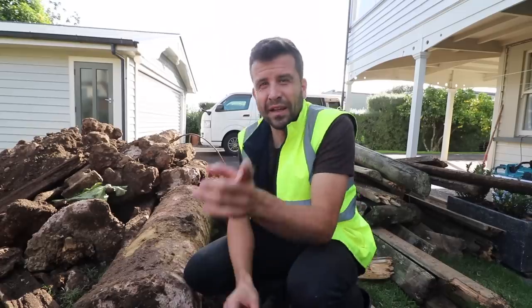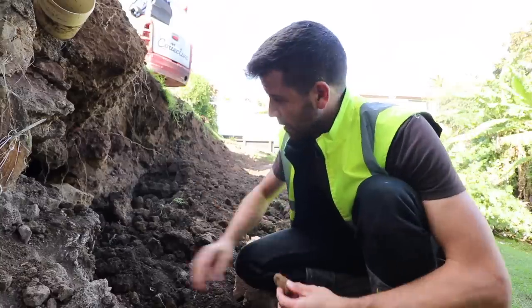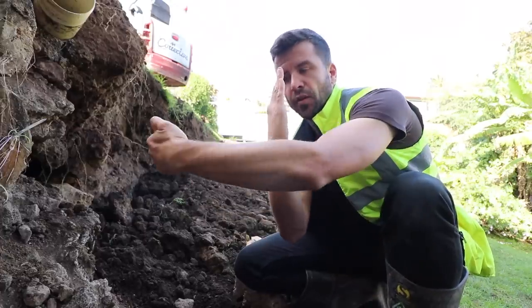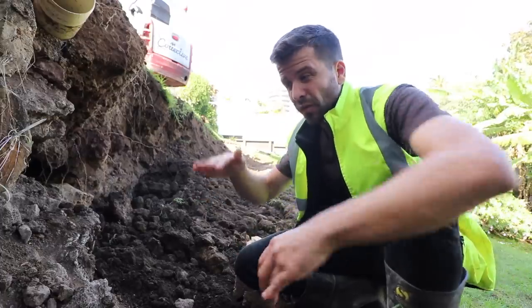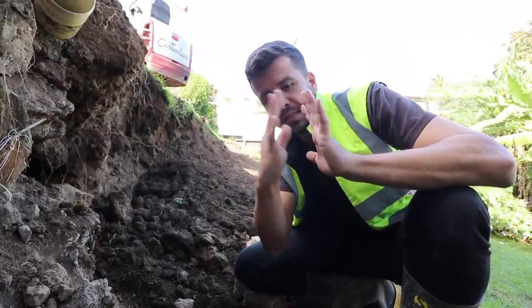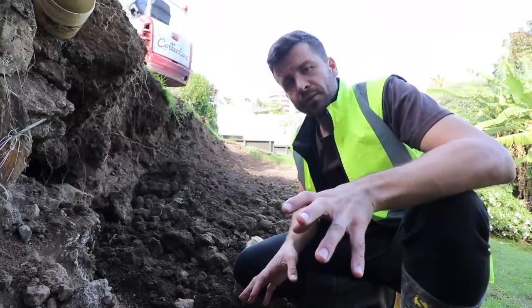Another factor was the drainage. There's some drainage right there — a little bit. We pulled it all up and there was drainage in here: scoria, which is porous and randomly shaped. When you put a bunch of it together it creates gaps that water can run through. From the timber wall it needs to go back to the dirt through a whole area of scoria. In this case, there was only scoria up to a certain height and then all soil above that. That soil just fills up with water and creates pressure on the timber wall. Combine that with the issues with the posts and the holes, and you get a crooked retaining wall.